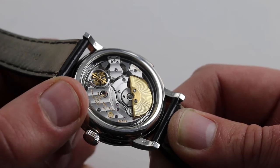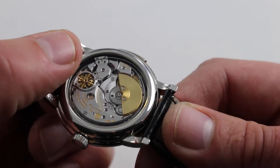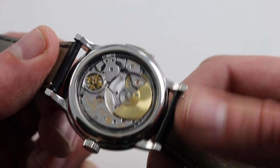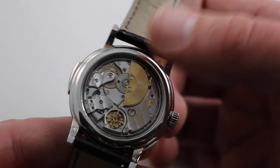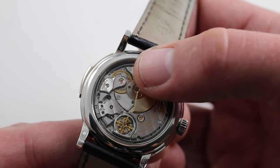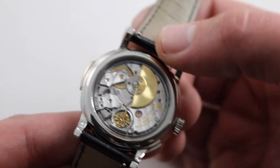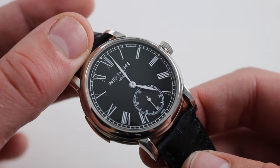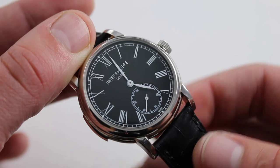In any era, those beautifully textured Côtes de Genève across the bridges simply stun. There's black polish on both the repeater hammers, which also feature a beautiful mirrored anglage with a rounded transition to their flanks, which are satin-finished, and of course the gongs are finished to the same standard. All of the screws have black polished heads with chamfered slots. There's a tight and even perlage across the base plate below the Gyromax-style balance beating at 21,600 vibrations per hour. Gyromax, a free-sprung balance architecture used by Patek Philippe since about 1950, allows the watch to take and hold a precise regulation, and is more durable in the face of bumps, vibrations, or disruptions on the wrist. You can see and purchase this extraordinary platinum automatic minute repeating Patek Philippe 5078P-010 on our website.